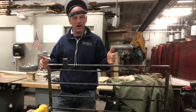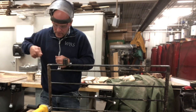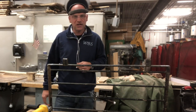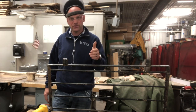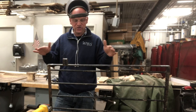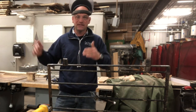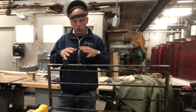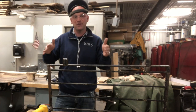We just want to be aware of what we're doing. Many times students get so wrapped up in what they're doing, they're not really paying attention and they're throwing sparks on another student, or on the oxygen and acetylene tanks, which is super dangerous. So pay attention to what's going on. Look before you even start — where is a safe spot to throw the sparks? And if there's no spot, then we have to create one. Maybe we need to take your project outside, or set up some curtains. We need to look at our project beforehand and position ourselves and our project in a spot where we can be safe.